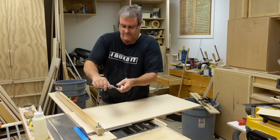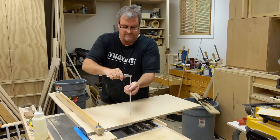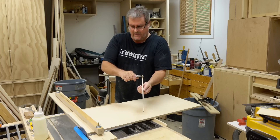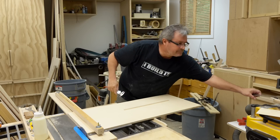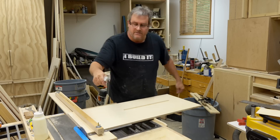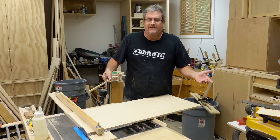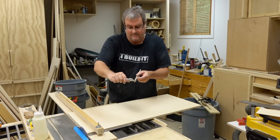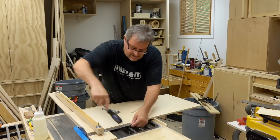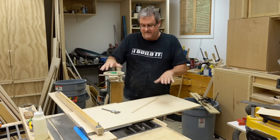Okay, it looks pretty close. I've got my calipers here to measure it - make sure they're zeroed. It's a comparison measurement. 45 thousandths on one side, 55 thousandths on the other - so I'm ten thousandths of an inch off on this cut. That's not too bad, actually, just for eyeballing it. All I did was take the square and put it up against the edge of the jig and squared that piece of steel to it. It has two screws - I could loosen the back one and push it in further, because that's where it needs to go. Ten thousandths difference; I could almost live with that. Even just tapping it a couple of sharp cracks would probably move it enough to fix that difference.